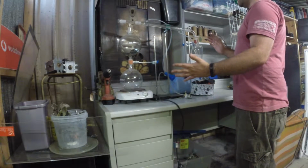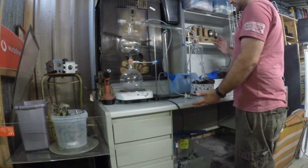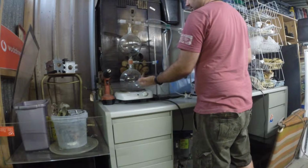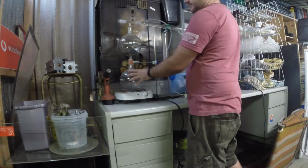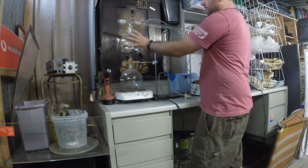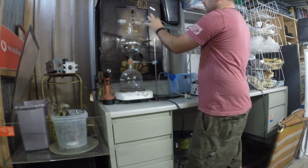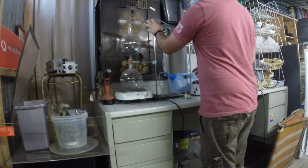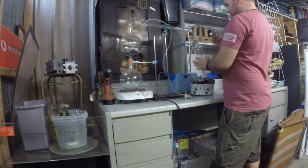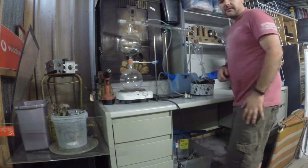There we have a distilling machine. Product in here, boils. Well, actually, that's a more basic one. You can put the product in here, water in here, the steam rises up through the product, comes up into the condensing tube. This is where the water condenses back in, comes down, and you have your purified product. Cool. We will fire it up.